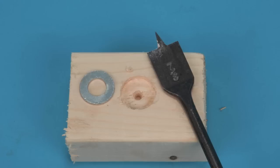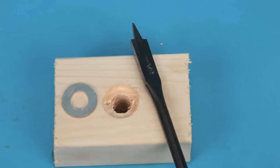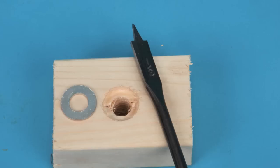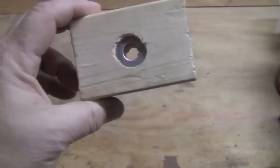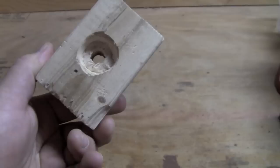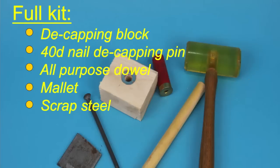With the 7/8-inch spade bit, just cut a shallow hole into your block — it only needs to be between an eighth and a quarter of an inch deep. Then take the half-inch bit and bore a hole straight through the block, right in the center of the circle you just cut. This is our finished decapping block. As you can see, it's got a washer, then the hole that the spent primers will fall through. I also relieved the back of it, and that allows you to build up some primers inside so you don't have to keep moving the block every time you take out a primer — you can deprime a number of shells and then move the primers out of the way.